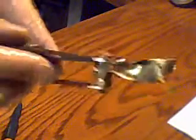Remember, all these rods are threaded. I've got the jam nuts in there — I've got them all locked in. I don't want this to move. I'm going to go ahead and put a nut on the other end with the lock washer. The single one is my negative leg, and the double one is my positive leg. I'm pretty happy with the way that cell looks. I think I've got a little bit more even spacing than I had before. I don't want those plates touching anything — nothing's touching anywhere. That's important.